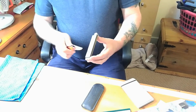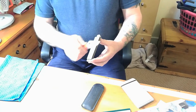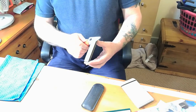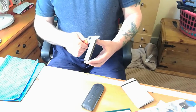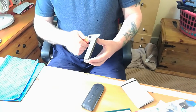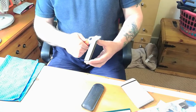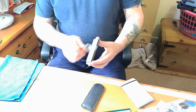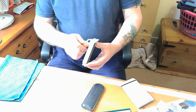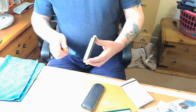And the reason I do it this way is you really want to keep it even. If I was doing this at home, I would have the black magic marker mark along my edge so that I know where it is. But in work, I just wanted this to be something that was just straightforward and you could go ahead and do it. This is by no means, you're not going to get a mirror finish on this. This is to get your knife back to sharpening. Say you hit a big lump of metal and it just blunts it like I just did with 300 grit. All this is doing is just giving you back an edge that you can get through your day.